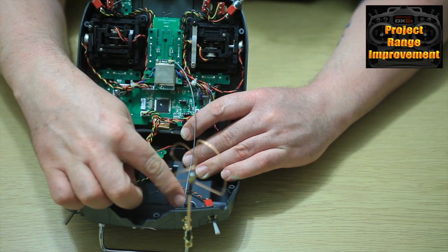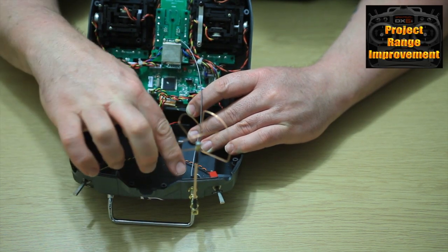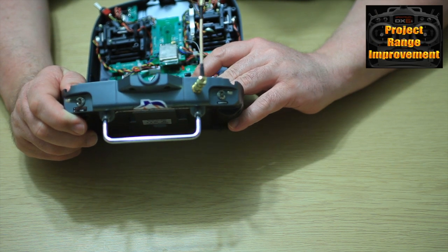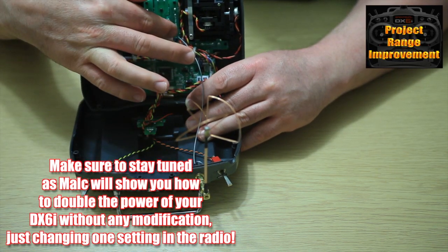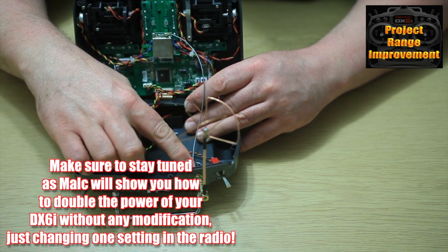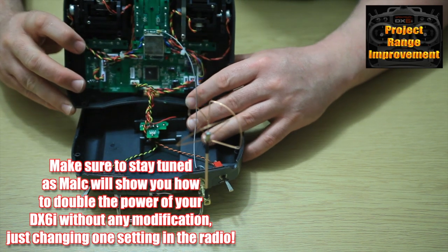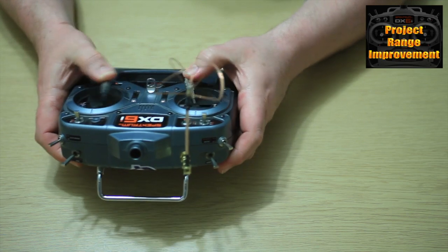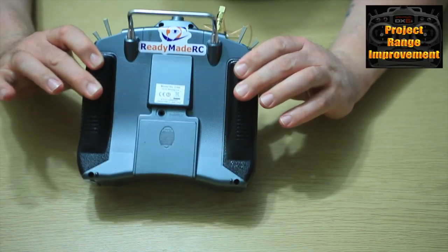Before you fit this UFL to SMA or RP-SMA, depending on what you're doing, you want to drill a hole like I have next to the handle. There's plenty of room there and there's absolutely nothing going on the inside other than just a little bolt. Pop your UFL connector on, do up the nut so it's nice and secure - you could put a little dab of thread locker on there if you want to just make sure it doesn't come undone. Pop your UFL connector on and then literally pop it back together. Just make sure there's no binding on your sticks, nothing's got jammed - check the gaps make sure your gaps look okay - and then replace your screws.